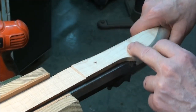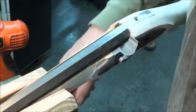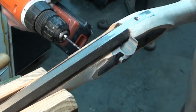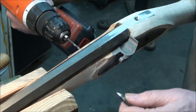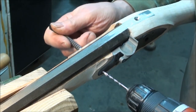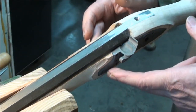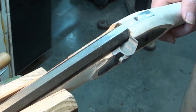Now I'll show you how to drill these holes all the way through. I've done this often enough that I can use some sort of center punch on one side, put my drill on the other side, and looking down at a 45-degree angle I can actually guide to the center point on the other side and drill through. I'll usually go halfway one way, turn it around, and go halfway back the other way. But if you're not careful, you'll get all cattywampus and the hole will go off center. So I'll show you another trick — if you've got a drill press it'll be a lot quicker, easier, and it'll go in straight.